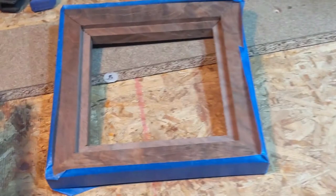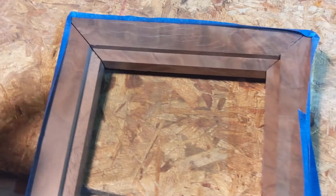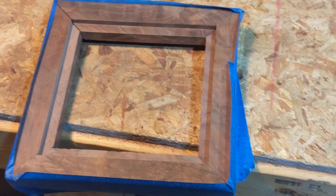Yeah, I think it's just going to be a matter of finagling it until it fits together. I've done all the measuring. It's 7.5 on the long side and 5 on the short side for every single one of those pieces, and a 45 degree angle on every single one of them. So it really just boils down to me getting them lined up correctly.